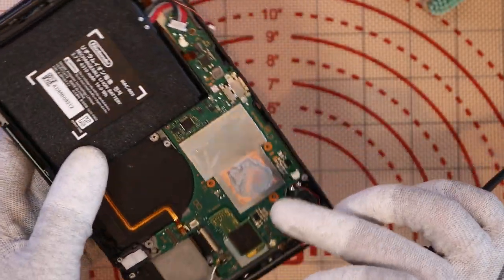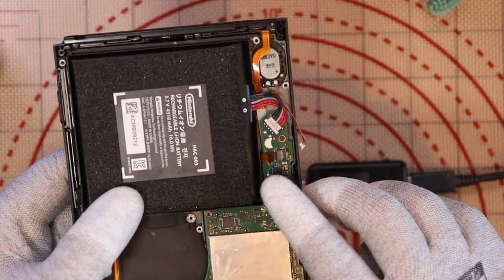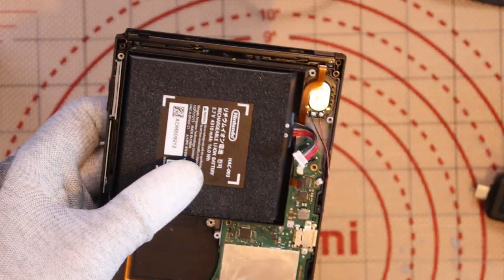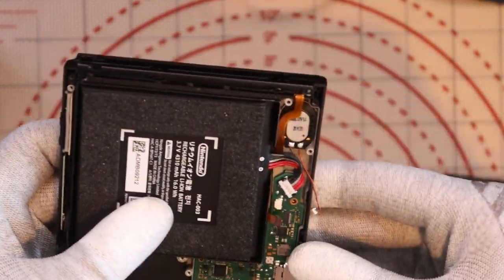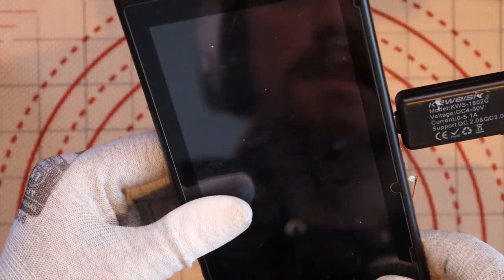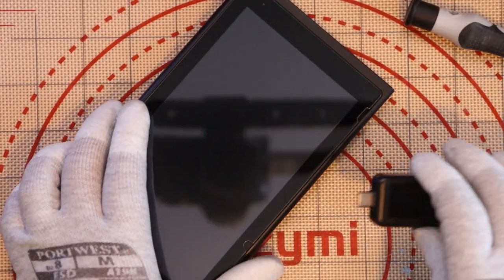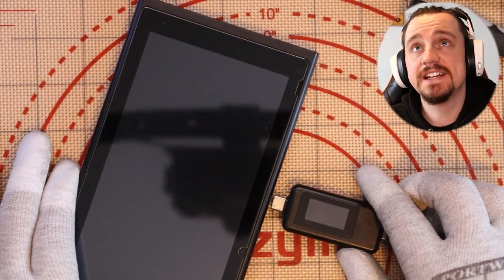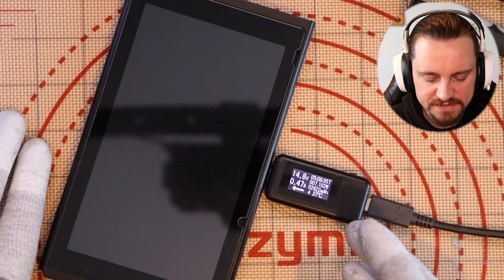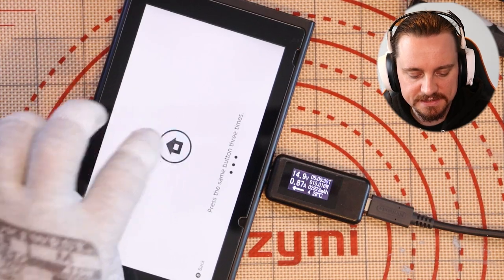M92-T36 has been changed. Still zero amp draw. BQ looked a little out of alignment, so I re-seated it. Testing again — 0.36, 0.47, we get backlight. Something on the screen — it's turning on! I put the back on, it says it's charging, then restarts — 920 milliamps. Touch screen works. We don't have parental controls. But I can't hear the speakers — volume is fully up and both are plugged in.